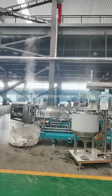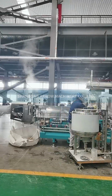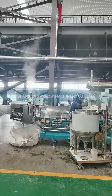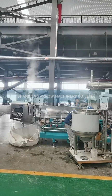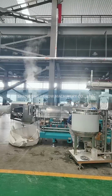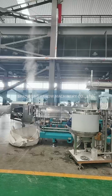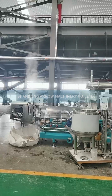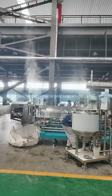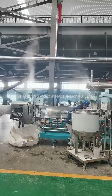And for the production, it is health food without animal fat inside. I plan to make the soya protein food by the double extruder machines. Plant protein gets stirred, conveyed, cleaned, and extruded by the twin screw, and the die nozzles make the production in the ball shape.